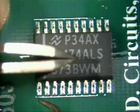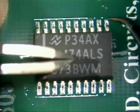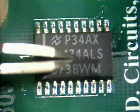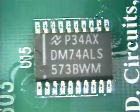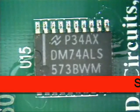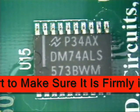Come with a clean tip, hit the one foot, see solder flow, then come off. Then come up to the opposite side and see solder flow. Now you have got this tack. One thing I always want to make sure of is that the part is not going to move, so I will slightly tap on it. There — it is completely secured into place.